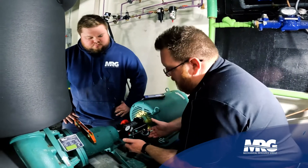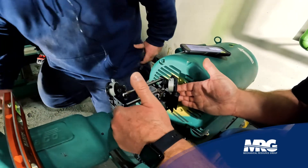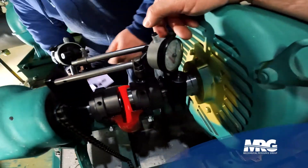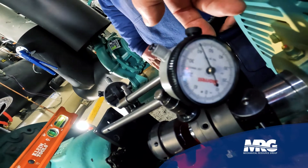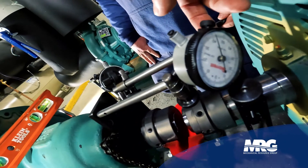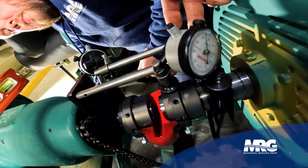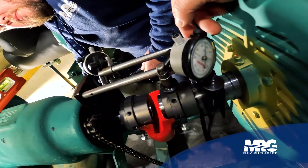After cutting in half, you rotate it back up to the top. One thing to look out for is what's called deflection — you can see as you're turning the shaft there's a wiggle in it. You have to account for that as you're doing this. It tends to want to move in one direction, so you just hold it back as you're going. You can see the shaft moving as that happens — you're just trying to keep it from moving as much as possible.